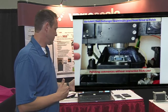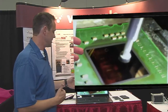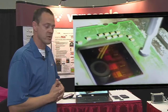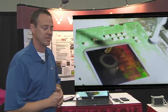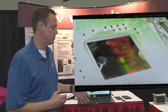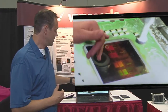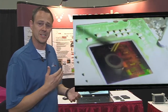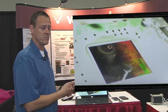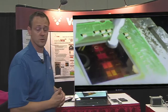Next we'll show you what it looks like once polished, still on the tool. You can clearly see the transparency of silicon under visible light — this is not external illumination, just the work lamp on the tool. You can also see the bottom of the polishing bit, which is highly specular from the polishing. The greens and yellows you see indicate you're in about the 2 to 3 micron thickness range.